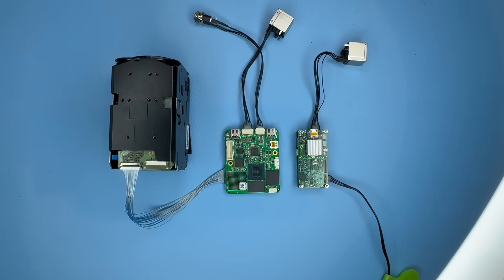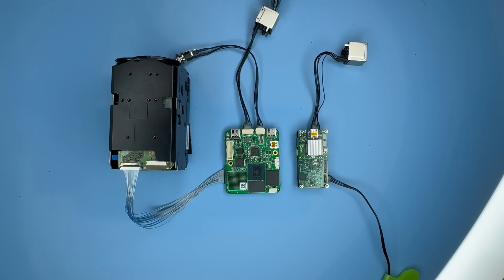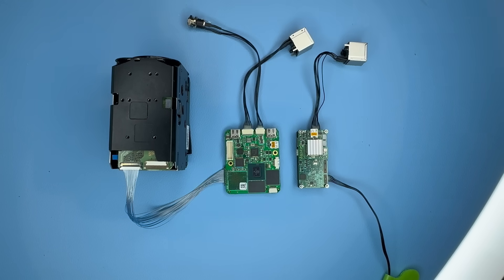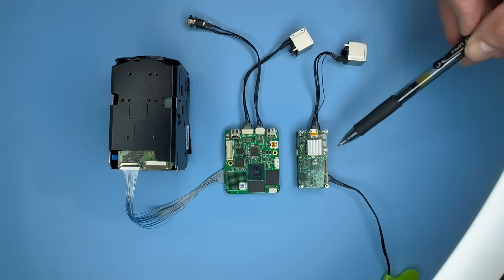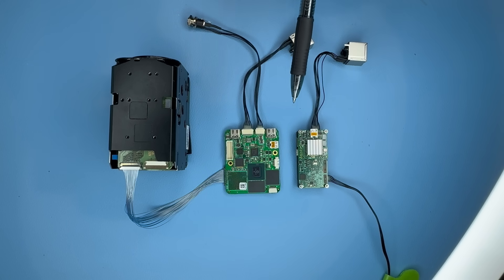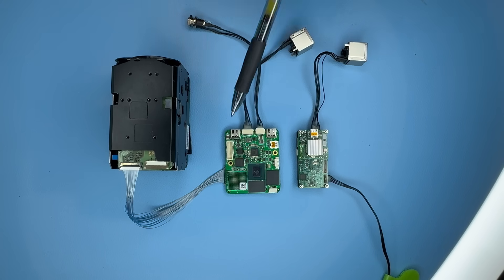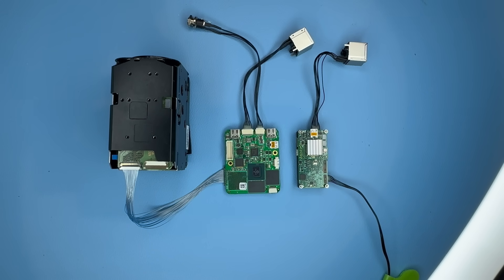This LVDS is designed for the Sony 9 series and also the 7 series. Just to finish on the hardware interfaces: we have power and ethernet. This one is 12 volt and this one is 5 volt. We also have some additional interfaces for RS232 serial interface on both units, and we also have interfaces for analog on this particular one. And if you want analog on this one, then you get a separate mezzanine board. So that's the ANT 1776 hardware.